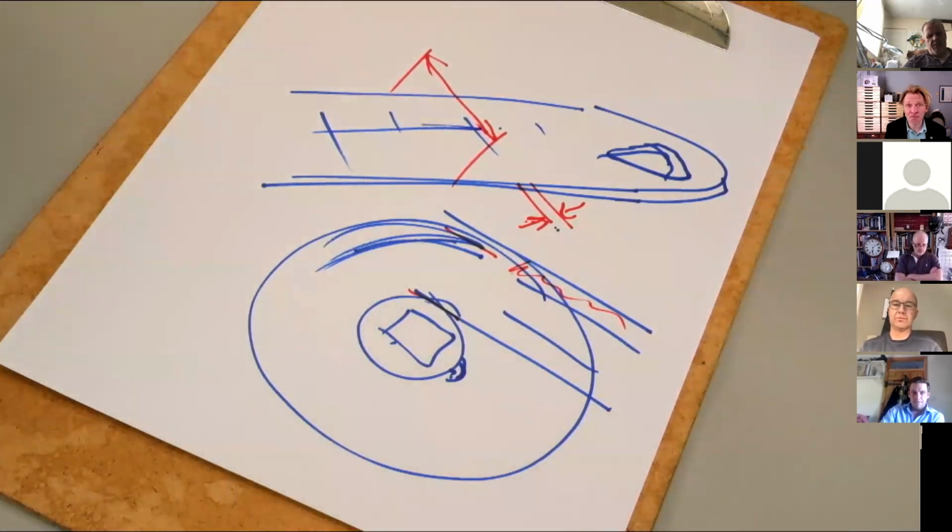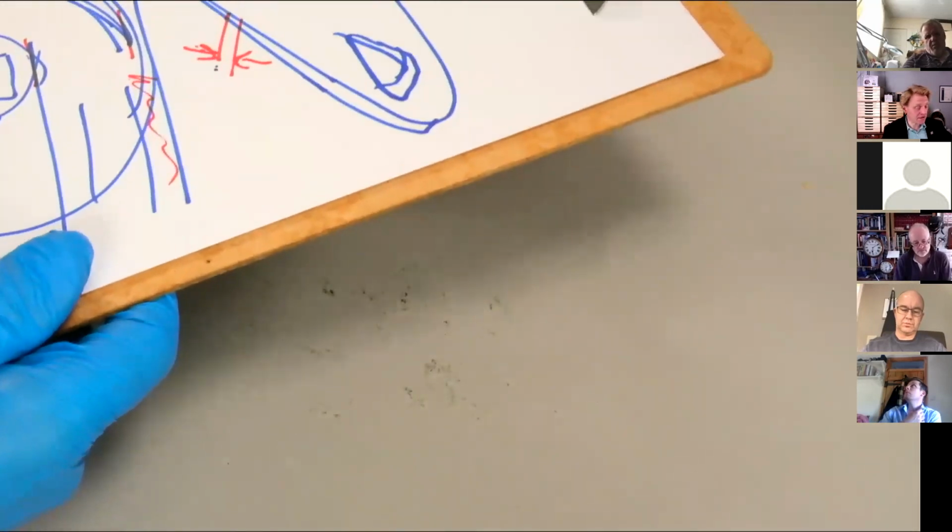So if you've got a good math brain or a calculator at hand, just take any value that you might find for a mainspring. Let's say 0.35 of a millimeter or 0.4 of a millimeter, typical mainspring value. And it doesn't matter whether you call it 0.4 or 40 or 400, who cares? Cube that value and then get a very similar looking value like 0.38 or 0.42 or 0.45 and cube that value. And you'll see there's actually a massive difference in strength of the spring with what seems like a little bit of difference in thickness of the spring.